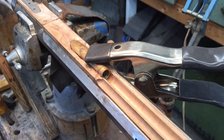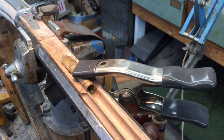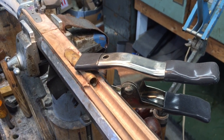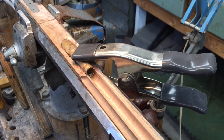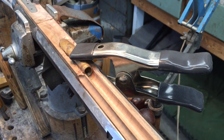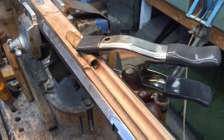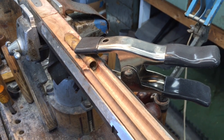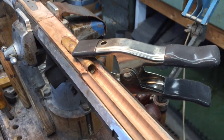All right, we've got the lower thimble all set in there and all glass bedded in. We're going to let that set and get good and hard before we try to remove the side panel off the barrels or to take the thimble out of the wood itself. The harder that epoxy gets, the easier it comes out. It gets a little more brittle.